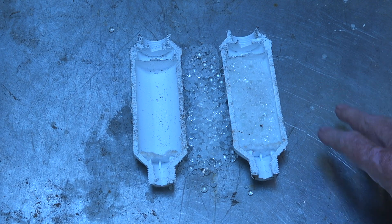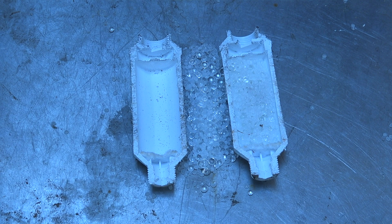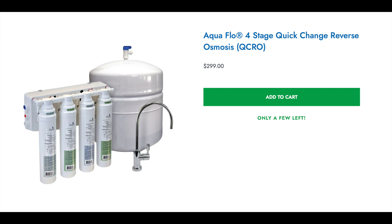If you wanted to reduce or almost eliminate minerals in water, you'd have to use something like an RO system — that's reverse osmosis — a far more complicated and expensive system. This filter is like $15; you can put three to five hundred dollars into a reverse osmosis system just to start with, and then you have filter changes. But do you really want absolutely pure water? No, you really don't — pure H2O tends to be corrosive.